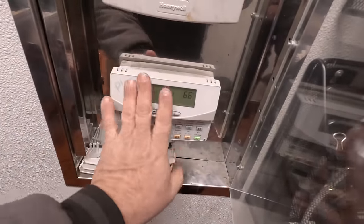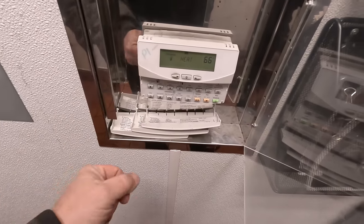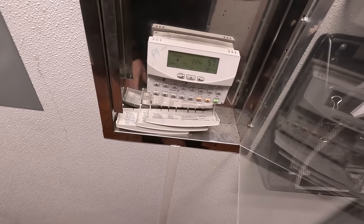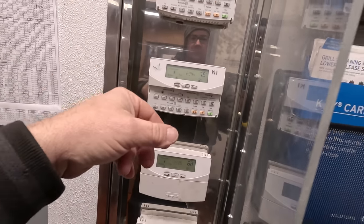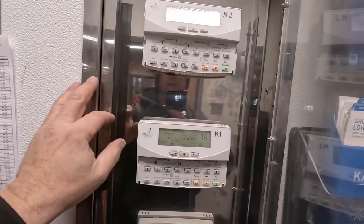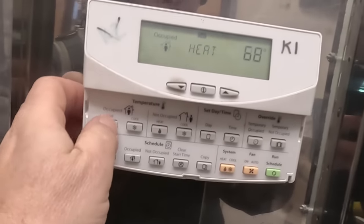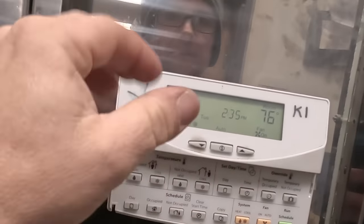Okay, playland out there — setpoint 66. So it looks like 66 is where the heat is set. You know, the kids are playing out there, whatever. Let's go ahead and lock this back up, just check scheduling on it. I think seven o'clock is where it shuts off, which makes sense while kids are out past seven — it's set cooler because they're playing and you don't want them super hot. Good to go on that. K1 is at 76, which is probably why it's on cooling. K2 is at 66 and calling for heat — it's just running its butt off. Dining room one set for 68, setpoint 68. At this point I don't see anything wrong. Occupied heat 68, occupied cool 74. Running schedule — it's running for cooling, fans set to on. Everything looks to be pretty good.